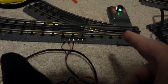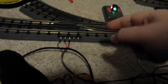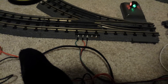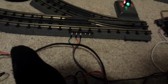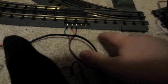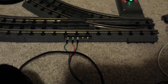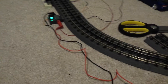This particular motor has two directions — forward and reverse — in order to switch the track in the middle. This red wire will control one direction while the green one will control the other, most likely using some type of opposite polarity switching, maybe electromagnetism. These two posts are for some type of AC source — what they call accessory power in the model railroad world — basically just another AC source so you don't have to tax the main AC source.